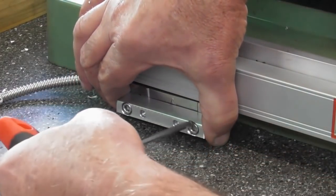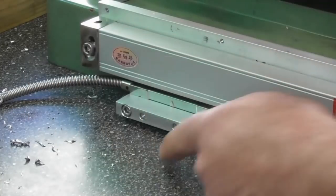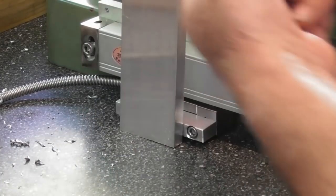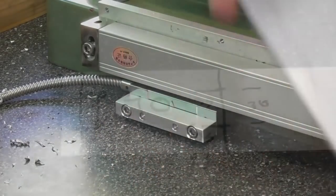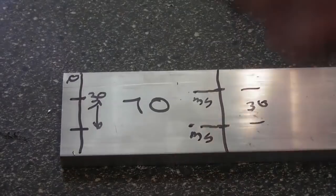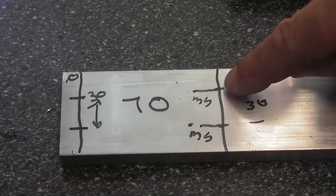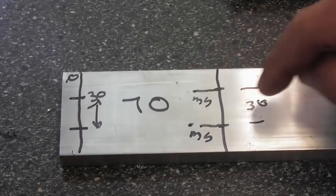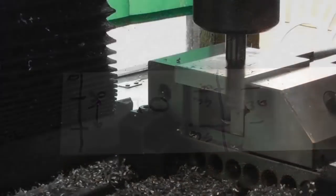I'm not going to tighten these quite yet — I don't want to put any force on the reader as it stands. So there's a spacer that brings me out beyond my small cover, and I've put two M5 tapped holes in the board. The idea is a piece of 50mm stock coming up — I'll cut it roughly the length I want and put those two holes in the end ready to bolt it on. The piece of bar is going to be 70mm long, with two holes 10mm up to match the holes in the smaller bracket, countersunk for M5, and then two M5 tapped holes in the end face at 30mm apart, ready to bolt the plate on at 90 degrees.